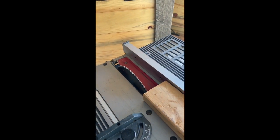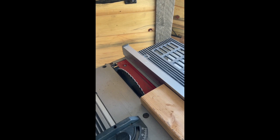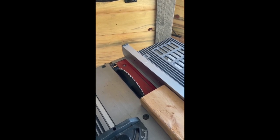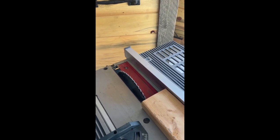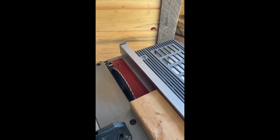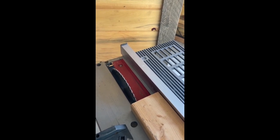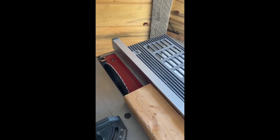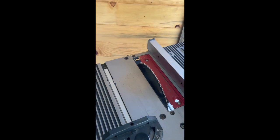I ripped down a length of a 2x4. I correct myself. I used 2x6s because I could get 2 lengths out of each one, but you could do this work with a 2x4. At any rate, the gap that you see there is the exact distance from the bottom of the expansion box, and I'll show you that inside, to the upper inner surface of the expansion box, and that's the dimension that we need for the thickness of the filler. So I made several lengths of this, and next I'm going to walk you over to this part of my outdoor area.